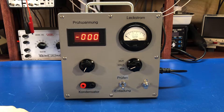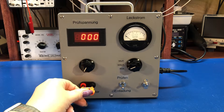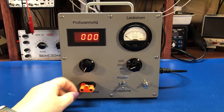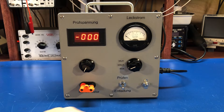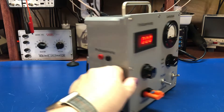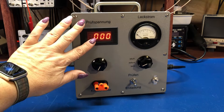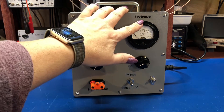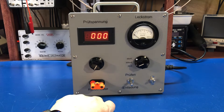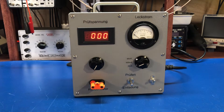At its heart, really all this is is a current meter — it puts a voltage through the capacitor, reads the current across a fixed resistor, and shows it to you. The build has got a spot for monitoring the voltage on a separate meter if you want. This shows you your testing voltage, and this shows you your leakage current in 1 volt per milliamp. We've got a 5 milliamp scale, 500 microamp scale, and 50 microamp scale.